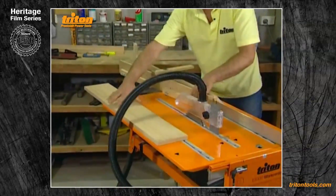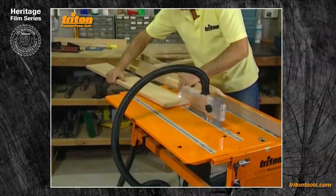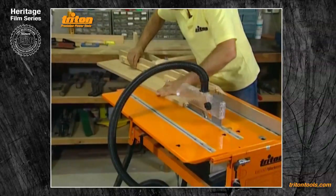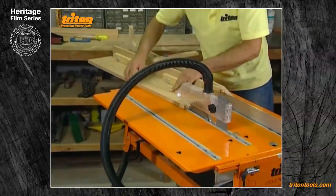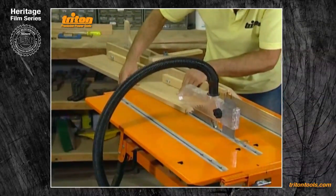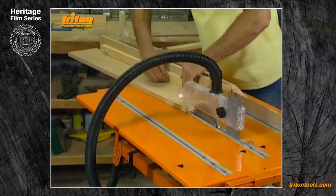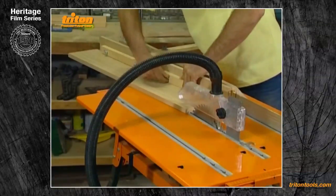All you do is put your piece in. Now this piece is about 1 metre long and should be able to cut it with no problems. Make sure it's hard up against this piece of MDF. Line it up in relation to wherever you want to cut. Then press down firmly so that the nail points dig in while you tighten the wing nuts.